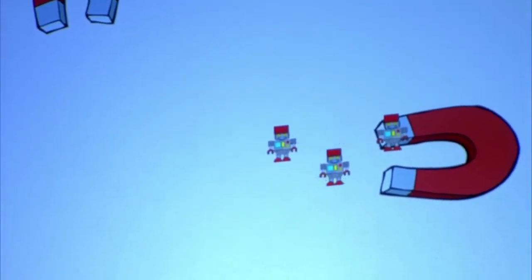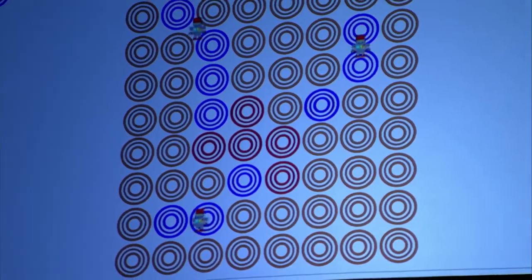So how can we do that? If we go back to our example with electromagnets and robots — if we have a team of three robots and switch these electromagnets on, all robots are getting the same global field and they'll all do the same thing. To get independent control, we can take these coils, shrink them down to roughly the same size as the robots, turn them on their end, and arrange them on the bottom of a petri dish in a big array. Depending on the direction of current through these coils, we can get an attractive or repulsive force on the robot, and by turning these on and off at the right time, we can get independent motion of teams of micro-robots.